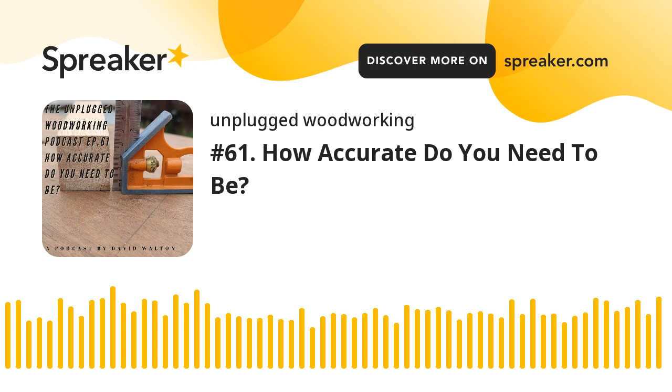So obviously you've got to have the angle on the shoulders. This isn't typically what you would see in the likes of a Windsor chair or a Welsh stick chair. There are actually shoulders cutting the shoulders that marry up to the underside of the carcass at the angle. This does actually lend some extra support and helps strengthen the joint, especially with the bottom piece being so thin — it's only about an inch.